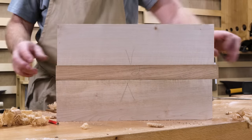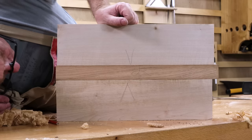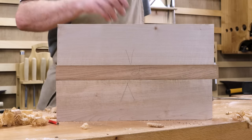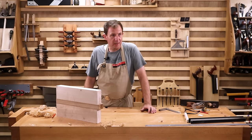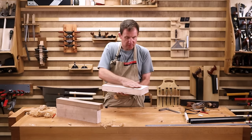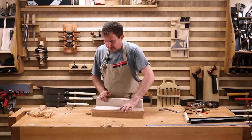Now this is gonna tell us at this stage, just from a visual look, how does that look on there? I'm gonna block the chisels out behind us. That's not bad. We haven't got a gap, looking pretty clean. So when we get to glue that up, that's going to be good. So at this stage, it's go get a drink, have a cool down. Next bit we're going to do, got to do exactly the same to the sycamore. I've got to mark a scribe line round it, and I'm going to level top edge, get that down, and then I can work on the outside edges. The bit of oak that we've got in here, still high in the centre.